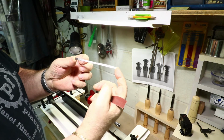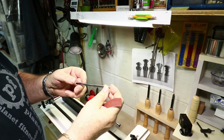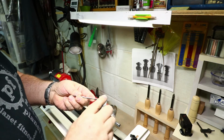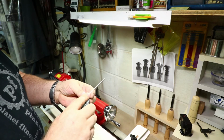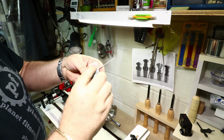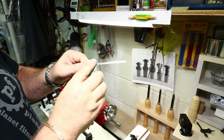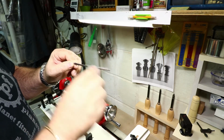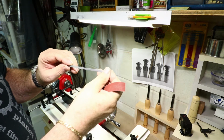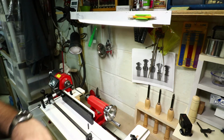This is a pen pattern, and it comes stamped out of metal, I'm sure, and it's got some rough edges on here as it comes. So I take some 220 grit sandpaper and just go over that a little bit, smooth it up to get any rough edges off, any burrs, anything that will make the follower pen hang up. We don't want that to get stuck as we're trying to go through there. So a little bit of sanding, that makes it pretty smooth, using some 220 grit sandpaper. Then we'll get that mounted into this guide.